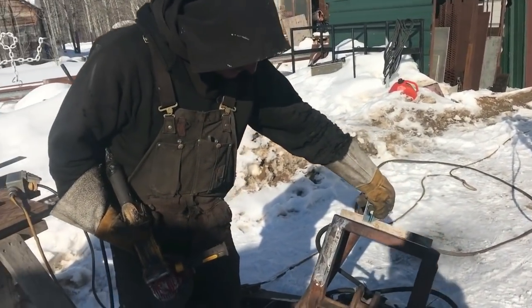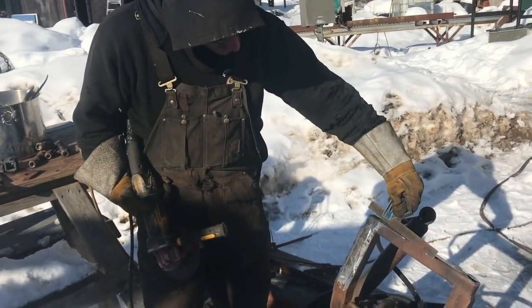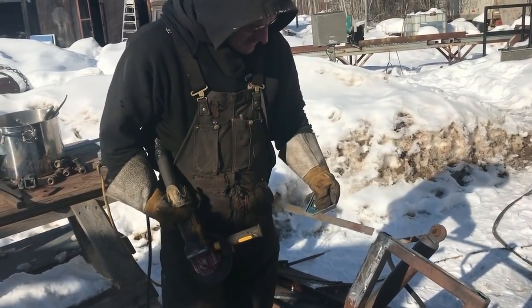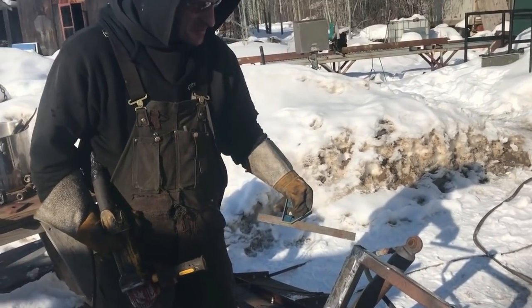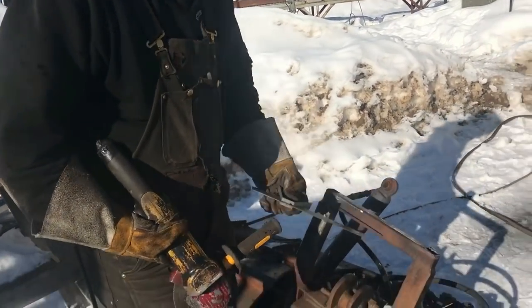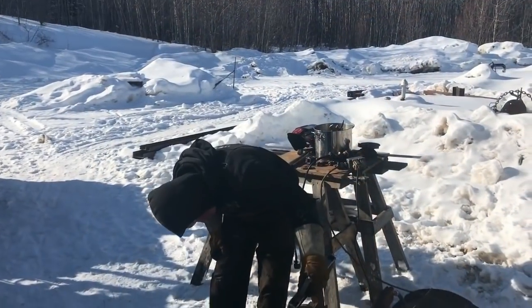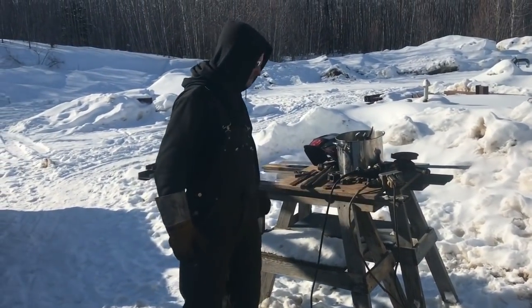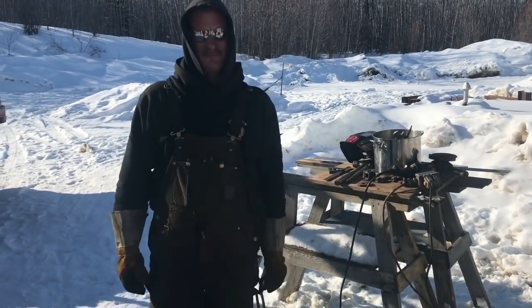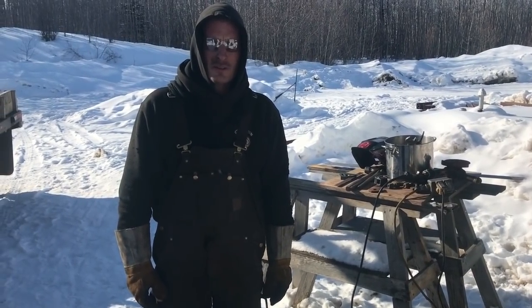Double check, put our straight edge on there, and oh look, we're flush with the top, we're square with the existing tube, and I've put my bevels all the way around so we can do a double bevel splice. We'll do the same with that. Perfect. Good enough for prep. Now we'll fab new parts and install.